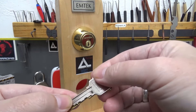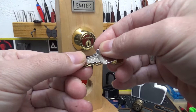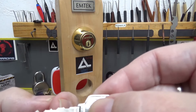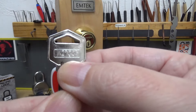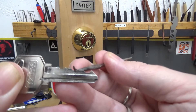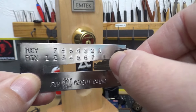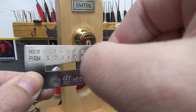So what I'm going to do is lay the original key over the top and line it up best I can by eye. The hardest one is going to be that one cut right there. If you look at the key bar it's got the cuts: 2, 1, 3, 3, 5 — that's the cuts on the key. We can verify that with this cheap little decoder. On the top are the key cuts and then you've got the pin numbers. Just slide the key in, don't force it. First cut is a 2, 1, 3, 3, 5. That's how you work that.